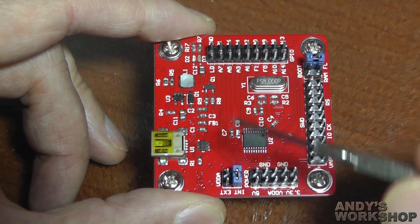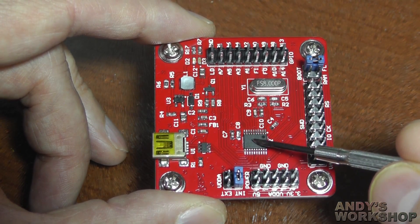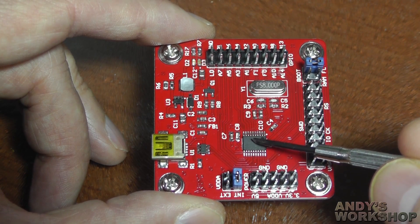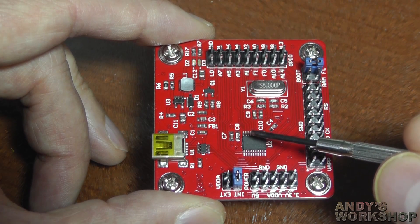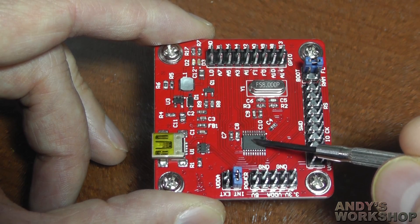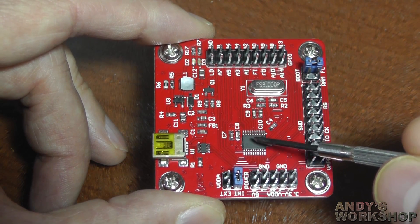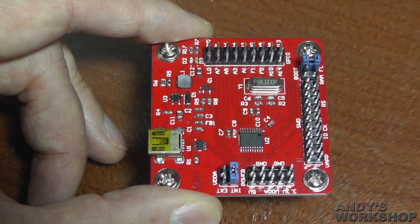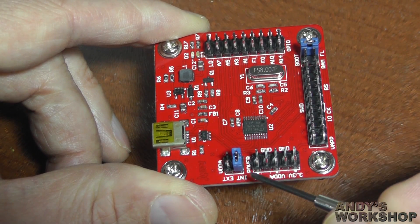On my website you'll find the code necessary for both enabling the USB peripheral — because the pins for USB D-plus and D-minus are multiplexed with GPIO and have to be specifically set up for USB before you can do anything — and also the code for clocking the MCU internally from the HSI48 and trimming it from the incoming start-of-frame packets from USB.